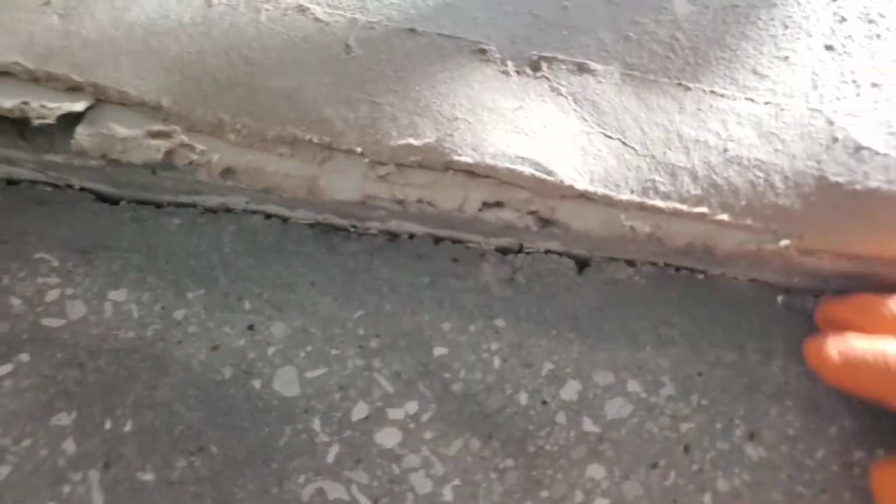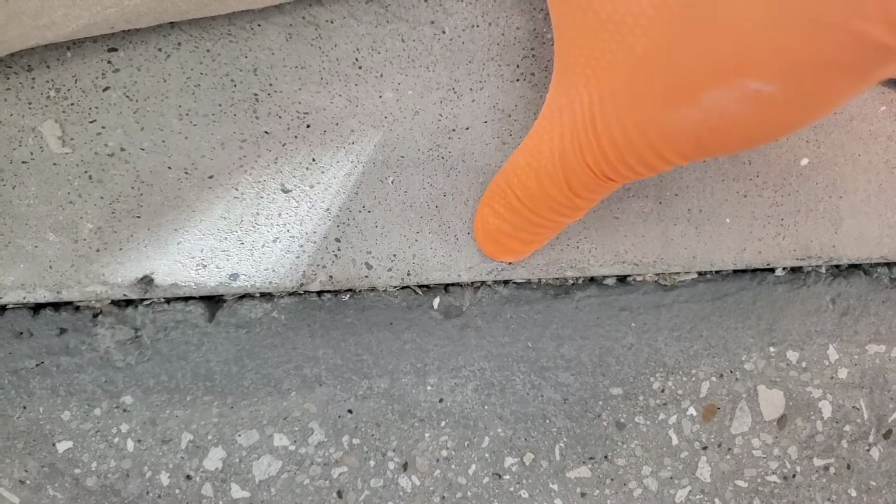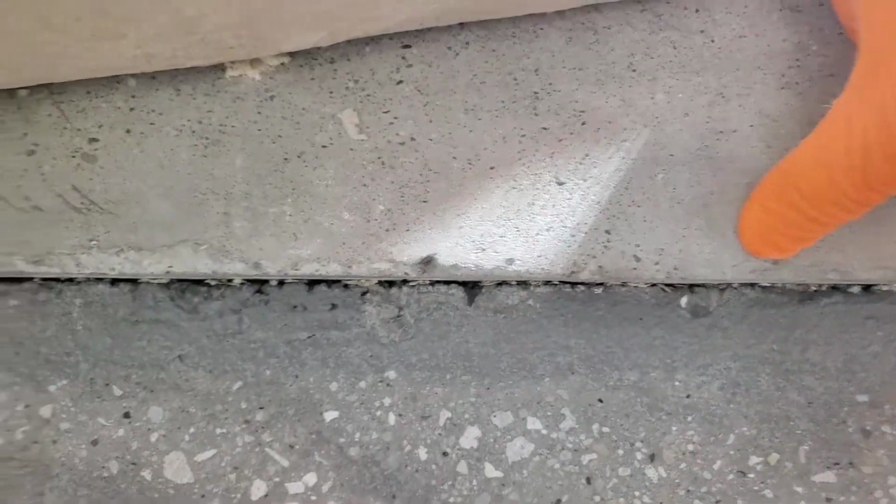All that was pretty straightforward. The floor's ground, the perimeter. I gotta map the floor and go over it, but I wanna show you guys this detail here in the doorway. In the doorway, so here's the polished concrete that's staying, but this edge is pretty chipped up. So I'm gonna put a new edge. I'm gonna take about 3/8 off.